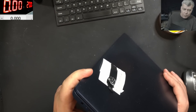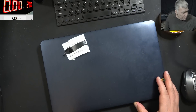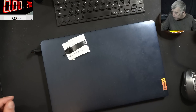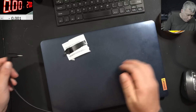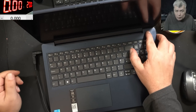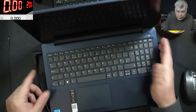Let's plug a charger. We have a round pin charger and see what it's doing. Maybe you can figure it out before we open the laptop. We found the adapter. Plugging in the charger — the laptop is doing nothing, it's taking no power. Pressing the power button: nothing. It's taking no current at all. Just dead.